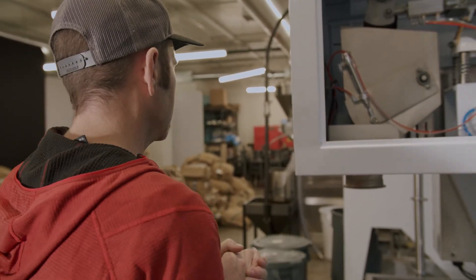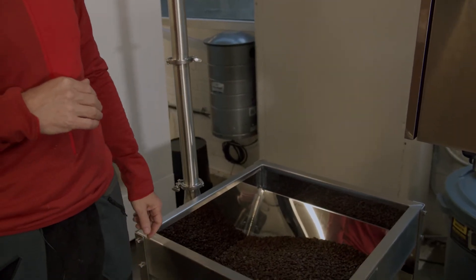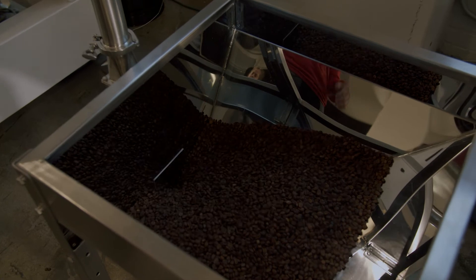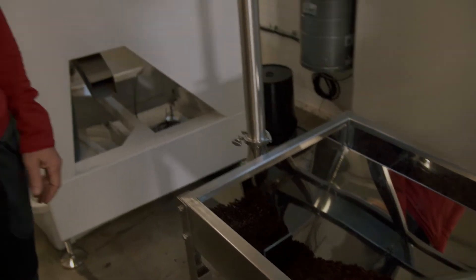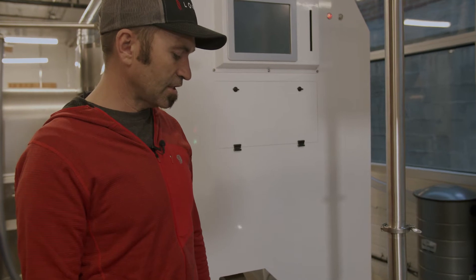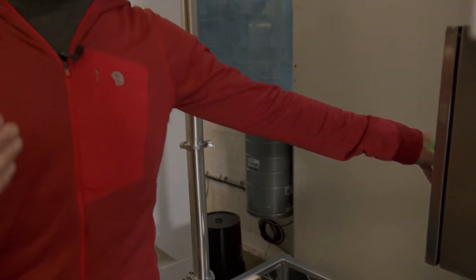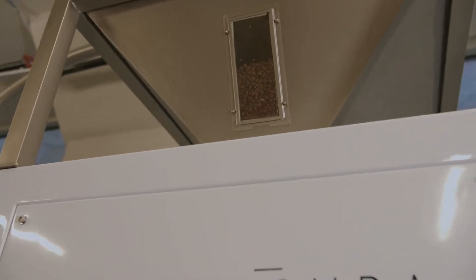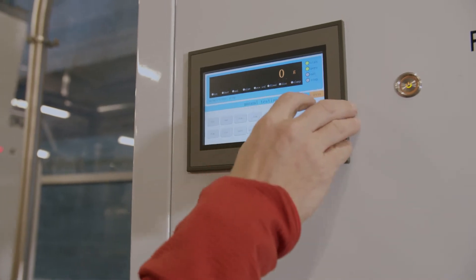Now we're ready to set up some recipes. We have our coffee here in the hopper. We're going to use the lift to lift it up today, so we turn that on. It's going to cycle through — that's normal. It'll shut off after cycling through the first time. When it's done releasing that coffee, it's going to cycle on again to grab the rest of the coffee. It's really important you let it go all the way through the cycle, especially on older models. Newer models will drop the coffee even if you don't let it go all the way through. Once you see coffee in the sight glass, close the discharge gate and zero back out.